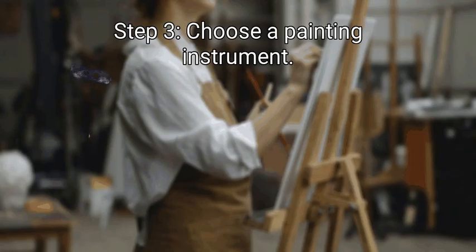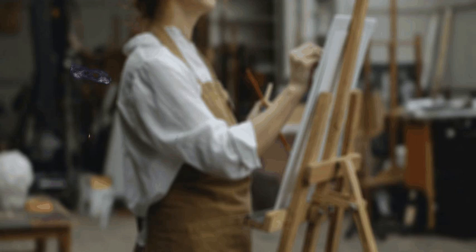Finally, choose a painting instrument. After you've cleaned the surface and fixed any major issues, you'll need to choose how you'll apply the paint to the wall. This is perhaps one of your most important decisions, as it's the simplest way to add texture to your paint job. Pick a roller with the type of texture you want. You can choose a smooth roller and apply your own texture after painting, or you could pick a textured roller. Textured paints have a lot of roughness that naturally hides imperfections, so they will look subtly different all over the wall. You can also use a brush to paint your wall — the brush will leave a light texture — or spray your paint on and apply more texture later.